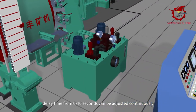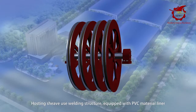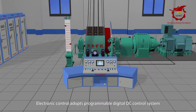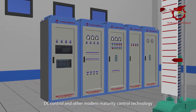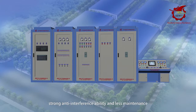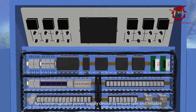The screw rod type depth indicator has a fail-safe feature and position limitation protection function. The hoisting sheave uses a welded structure equipped with a PVC material liner. The electronic control adopts a programmable digital DC control system using human-machine interface control, PLC programmable control, DC control, and other modern mature control technologies. It features easy operation, high reliability, perfect protection, strong anti-interference ability, and less maintenance. The system uses a double circuit supply with an uninterruptible power supply device to ensure safe and reliable operation.